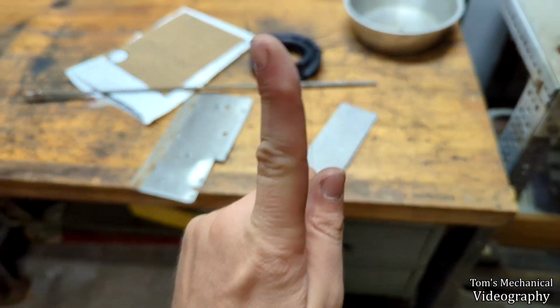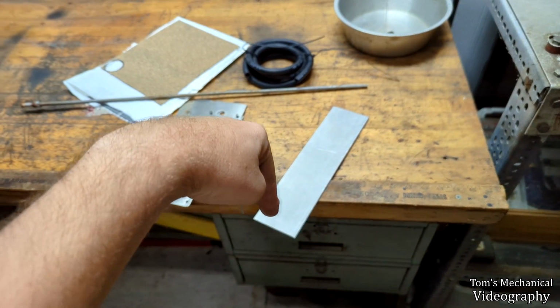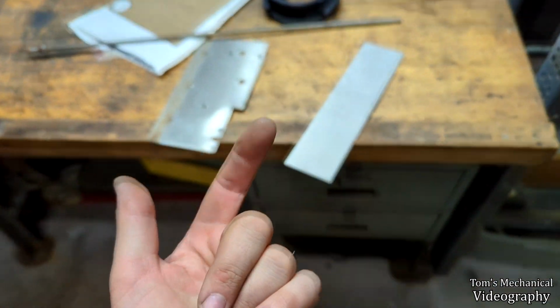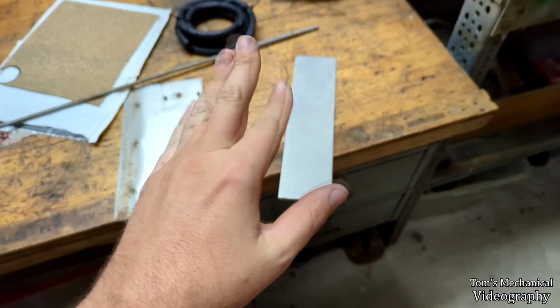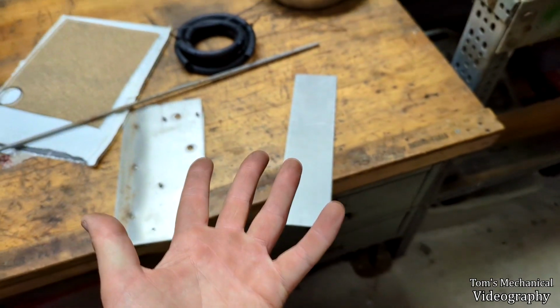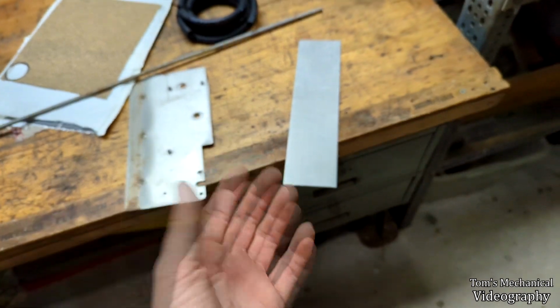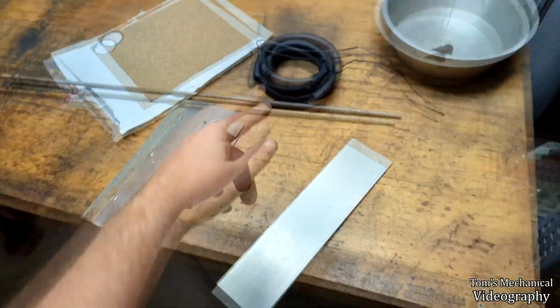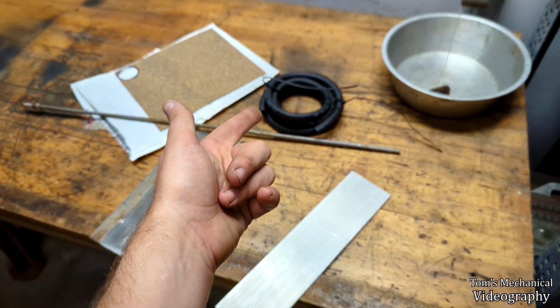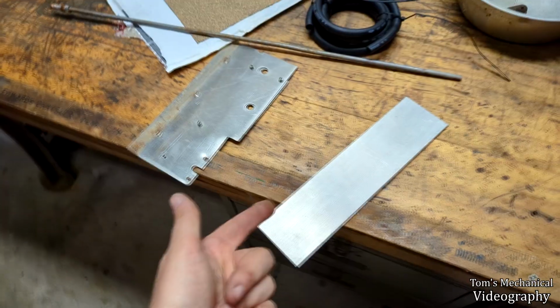If I can get a coupler that's barb on top with threads coming down the bottom, then I can just run a nut up to the top of that, seal it, put a little bit of gasket maker, some shmoo, or a little bit of gasket material, or maybe even an O-ring. Maybe I can find one that's got O-rings in between it, to seal it off from water. And then on the top, we can just straight plumb some new 5/16 fuel hose from the fuel filter that's there directly onto that barb.